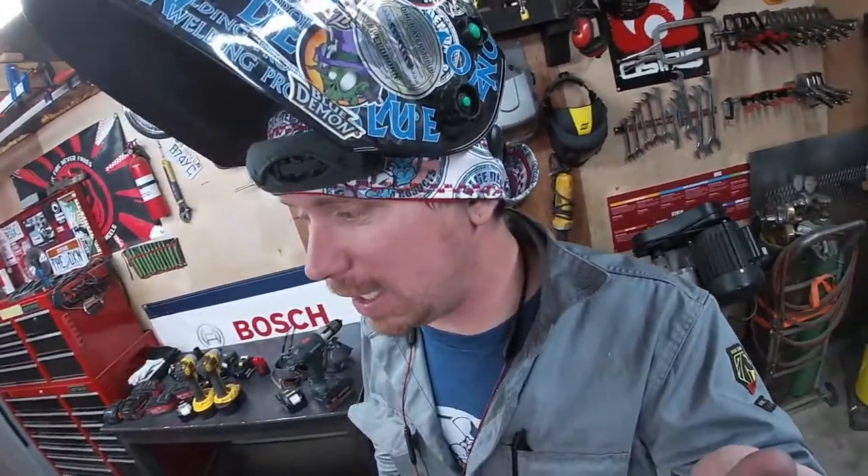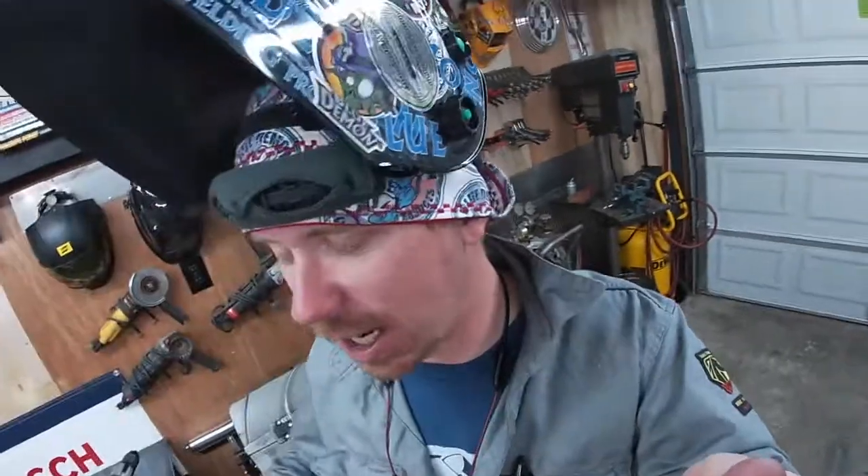Holy cow, dudes. I forgot to turn my water cooler on for that whole tack session. I thought for sure my power line was going to be burned up — I thought for sure it was going to be melted, but it's not leaking anything. I got so lucky I didn't actually lay a real weld. You cannot run a water-cooled setup with your water off and think you'll just burn real fast — no. You'll melt your TIG torch cables. Bad. It happened to me once, it sucked. I burned them up. Got lucky this time.